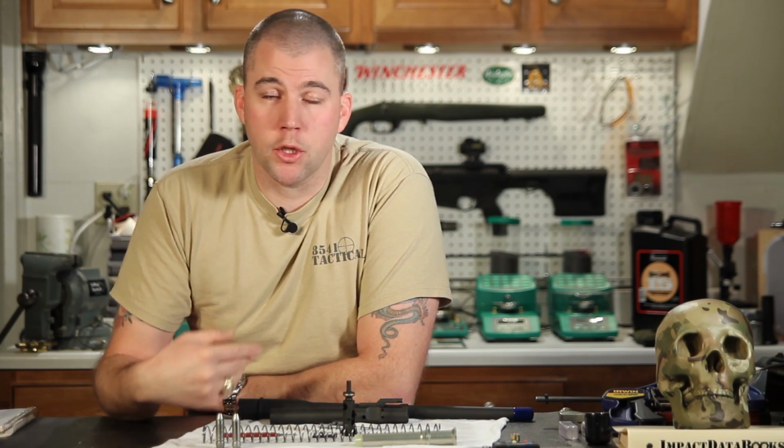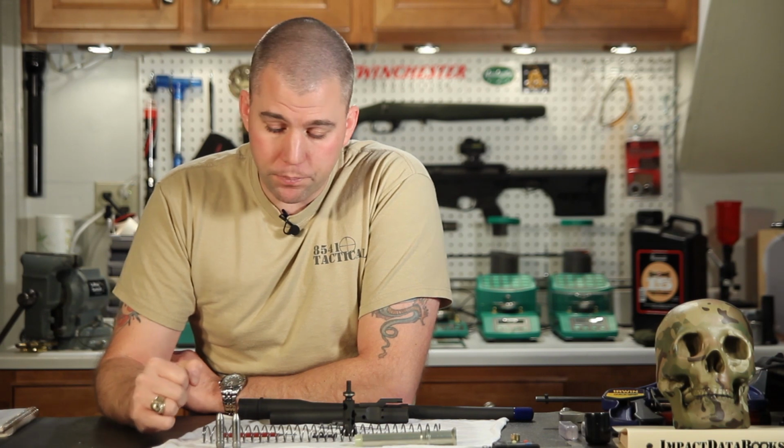They're designed to determine when a rifle has become unsafe, either because of wear or because of damage to the rifle itself. If the rifle chambers a field gauge and the bolt will close on a field gauge, just like you saw us do on the go gauge, that means that a potentially unsafe condition exists and you may have cases rupture if you fire them in that rifle.